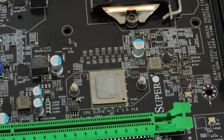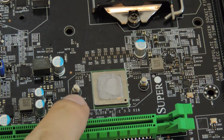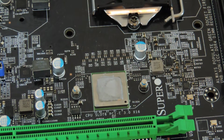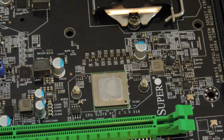So here, they just straight up unscrewed out of the heatsink. This happens on many boards. You can actually take pliers, hold it down, unscrew the screws, and screw this back into heatsinks. But really, what's the difference, right? The same amount is going to be re-screwed into it. The same amount of pressure is going to be applied, so not a big deal.